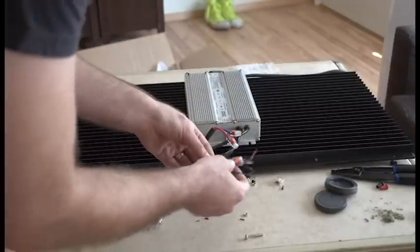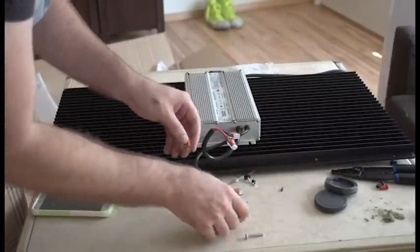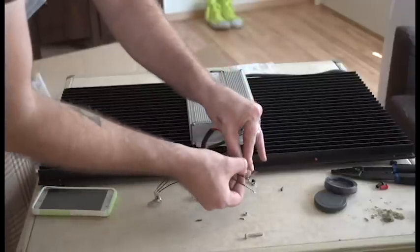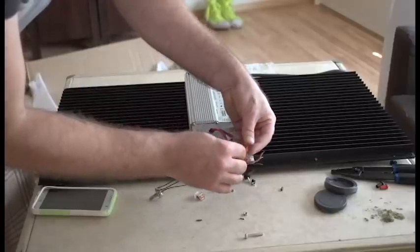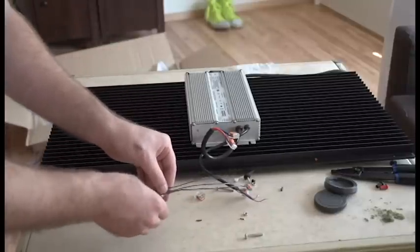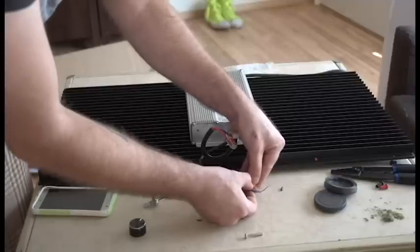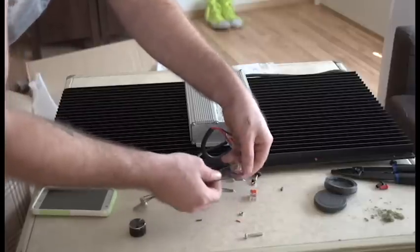Then you're going to take this left wire and you're going to put that to the purple wire. Okay? So this purple here. And then you're going to connect that to your left wire on the potentiometer. That seems to be all good and copacetic there. So now that that is connected, you would put your knob on, and that's how you're going to adjust your light. However, for this video, I'm not going to have the potentiometer wired in.